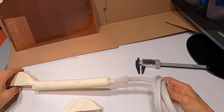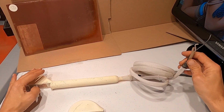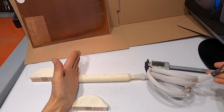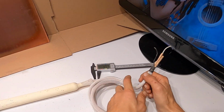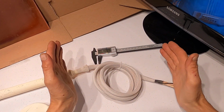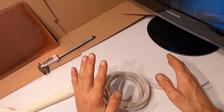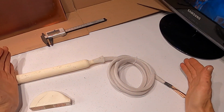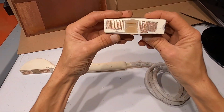Alright guys, another thing, you make your wire from this point here to this point here 7 feet. By the time you insert it into the coil and insert it into the unit, you're gonna end up with about a 6 feet section of the wire, and I have learned that 6 feet is the optimal length. It's not too long, it's not too short. So you want to cut your wire to be 7 feet originally, and you'll end up with about 6 feet once you install everything.